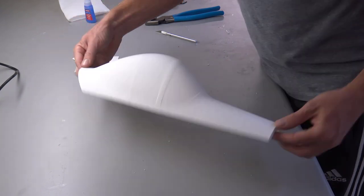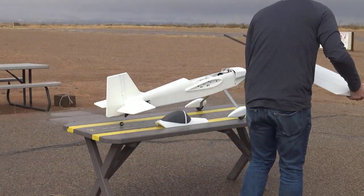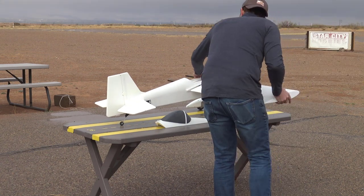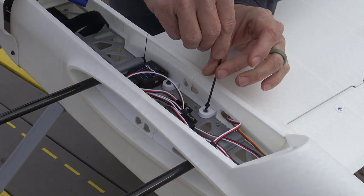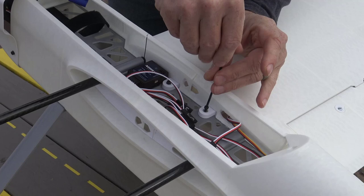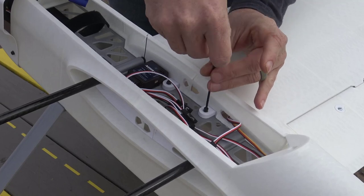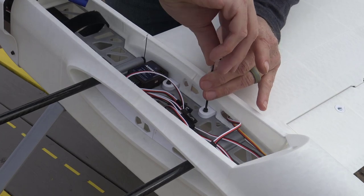The only difference with this design is how the wing halves bolt onto the fuselage. I designed two small tabs in each wing to slide into the interior of the fuselage and bolt into heat set threaded inserts that are sunk into the rigid plastic tray that runs through the interior of the fuselage. Combined with the carbon fiber tubes that run from wing tip to wing tip, this makes for a super strong wing connection.